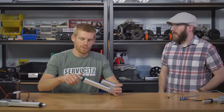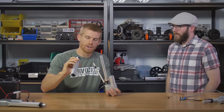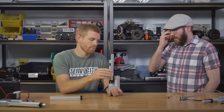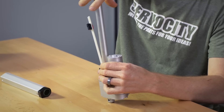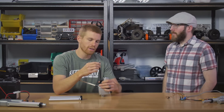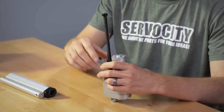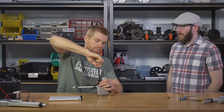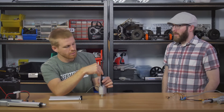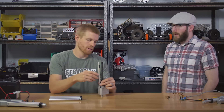I'm going to start at the top here and take the cover off, which is going to expose the shaft that extends out. This cover has a profile that holds the limit switch rail — you've got an outboard and an inboard limit switch, and it's held in place nicely when that's put in. Then you've got the aluminum extension tube, which exposes the acme rod — basically a threaded rod that's nice and polished — and then it's got a Delrin nut on it that runs up and down. As this rod is rotated by the motor, that Delrin nut is going to move up and down. With this in place, the little finger off the side of the nut is going to contact the limit switch at either end and just kill power.